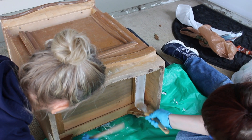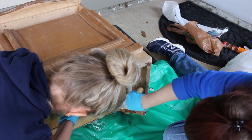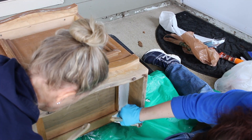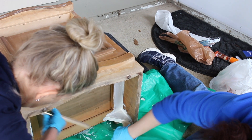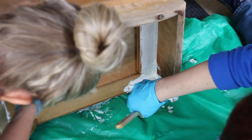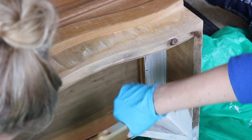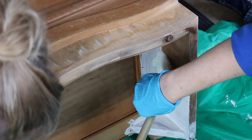Some people like white so you might see how it will look in white — I'm not one of those people, for the record. We're not going to finish it white. The purpose of the Kilz is to remove any stains that could be visible on the final paint and also to seal the piece and reduce odor. We'll do another short wipe and then we are ready to start with the Kilz inside.